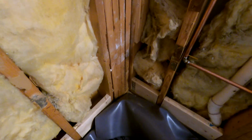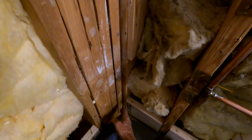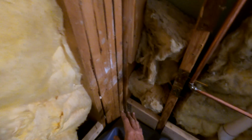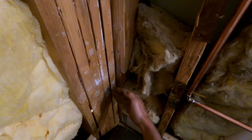This is one of the things that throw people a lot because of the folds and all that stuff, and it's very, very easy to make this happen. Let me back up. There's a lot of people that will talk about putting the excess pan liner in the corner in between the studs. Sometimes there's an opening, but more often than not there's not going to be an opening, because as you can see clearly there are studs going that way and studs going that way, and it doesn't do any good.